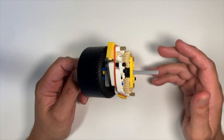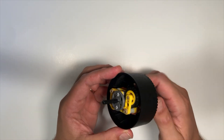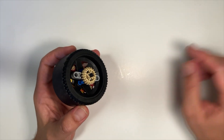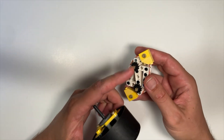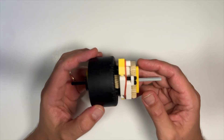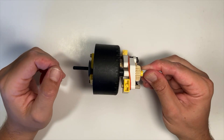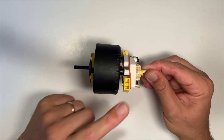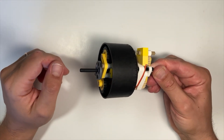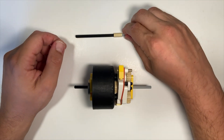How do we achieve the maximum gear ratio? This is where the clutch and the drum become relevant. The clutch is calibrated so that when the output shaft reaches the appropriate speed, the shoes expand from the center and begin to grab the drum. The drum is actually fixed in place relative to the spindle because these three axles keep the two parts aligned. So when the clutch begins to accelerate the drum, the drum then accelerates the spindle with it. At this point, a positive feedback loop is created because the drum accelerating the spindle accelerates the clutch even more, which grips tighter onto the drum, thereby accelerating the system even more. This acceleration keeps happening until the clutch, the drum, and the spindle become completely locked together, turning this whole system into essentially a single axle.